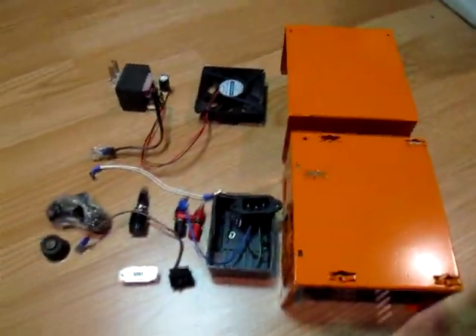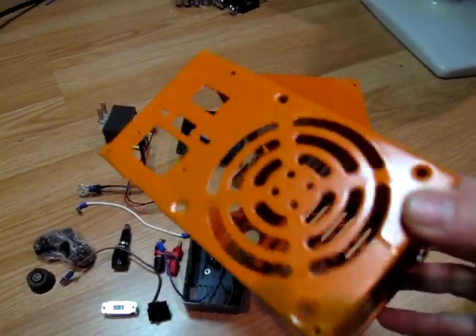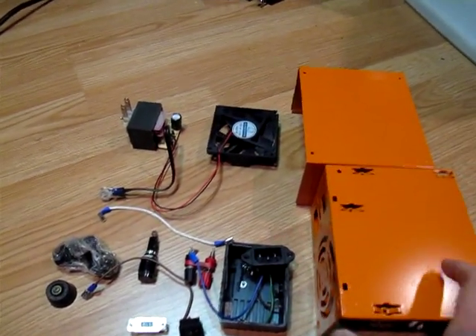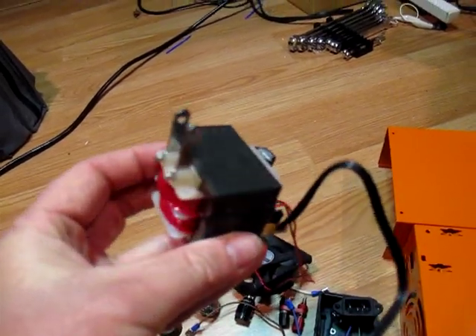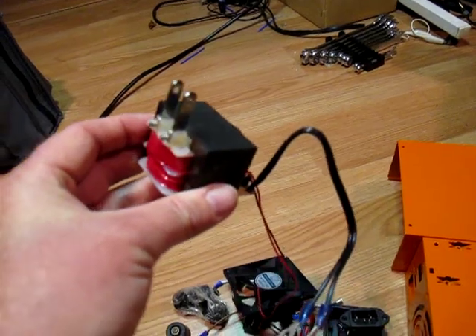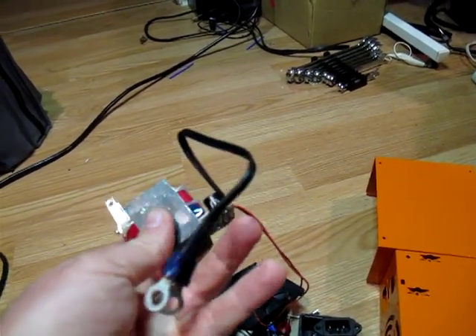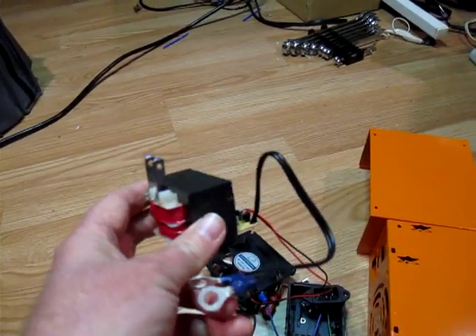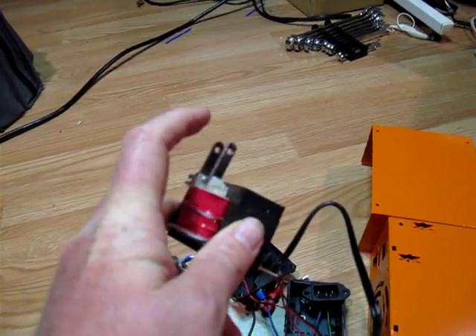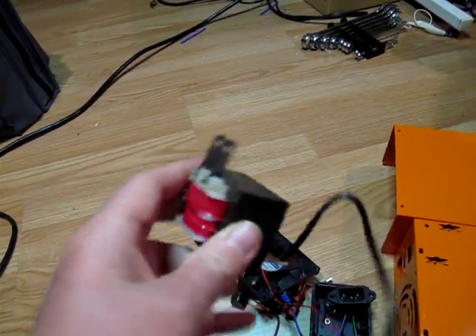Here are all the parts for my power supply for building the foam cutter. I painted it orange with Rust-Oleum orange gloss on the shell of the power supply. I'm using a 15-volt supply — about 15 volts at no load, 12 at full load — at 1.2 amps. I cut off the power cord and put crimp terminals on it, going to put terminals on the plug and mount it inside.